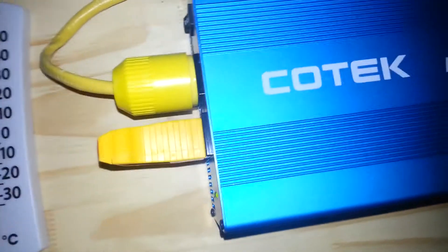This is a big relief because certain things won't work well unless the neutral and ground is bonded. Following the conduit here, you can see my ground bar right here — it actually goes outside my shed and runs about four feet into the ground. I'm going to take you outside right now just to show you that we actually have a ground.